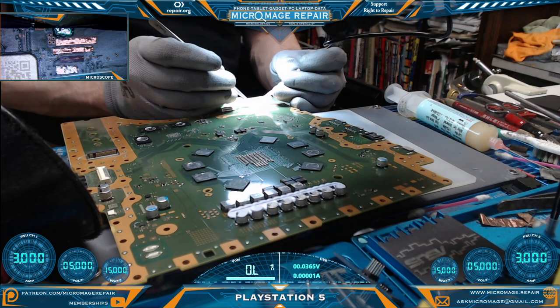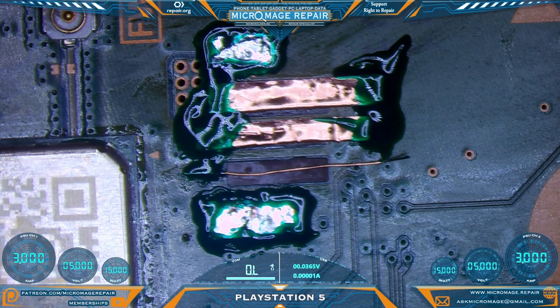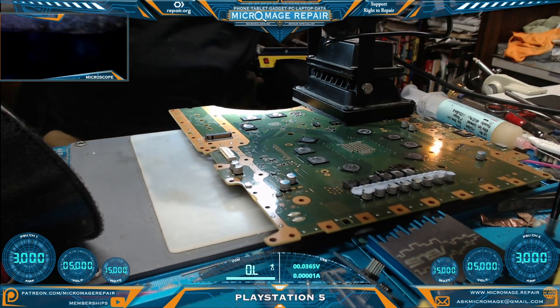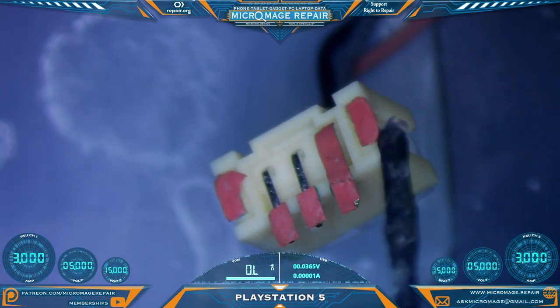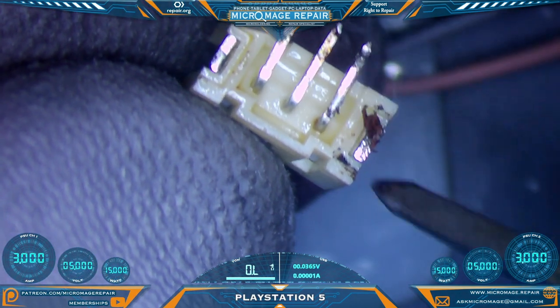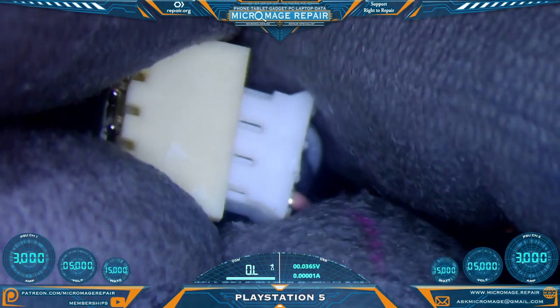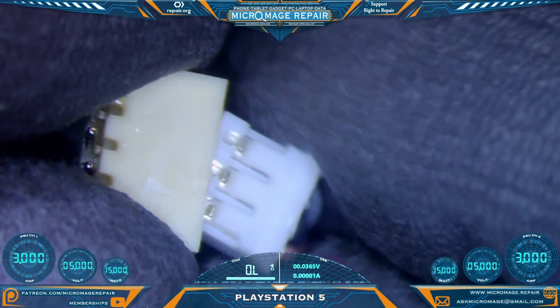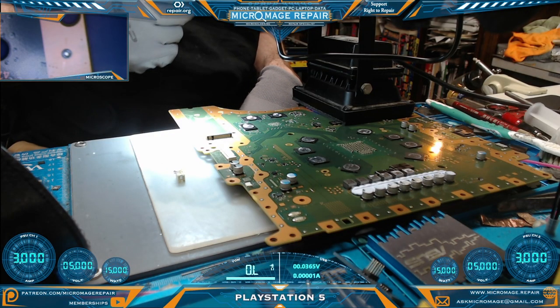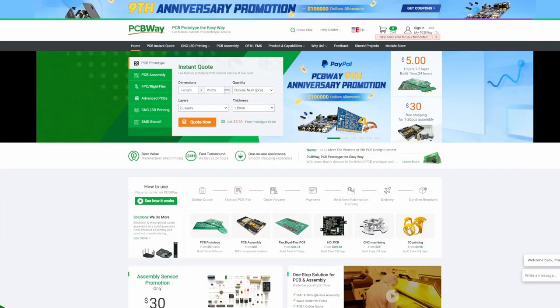Some UV coating around everything. Really don't care about looks here — if you were worried about looks, you shouldn't have ripped off your connector. I wouldn't call it pretty, but it will be functional. Grab our big UV lamp, stick it on the board, and let that cure for a good little while. In the meantime, we'll do some connector prep — these pads are not going to do us any good. We're removing them from the connector, just rock it back and forth and it'll come out eventually. I'm going to step away for a few minutes, let this finish curing, and then we'll come back and complete the work.